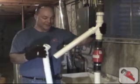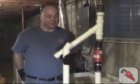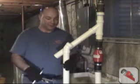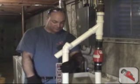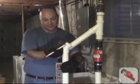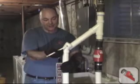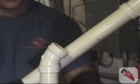We could use a formula to figure this out, but to make it easier for everyone else, we're going to put it up against the travel piece right there. We're going to use a torpedo level. Now right here will be the back of the fitting, which is the end of the socket. That is where you're going to want to make your mark on the travel piece. We'll remove the travel piece.